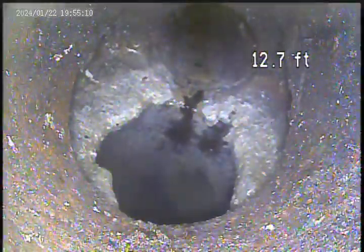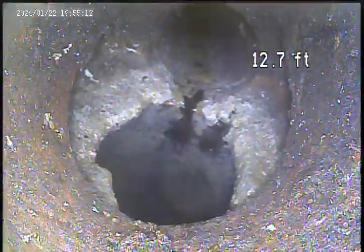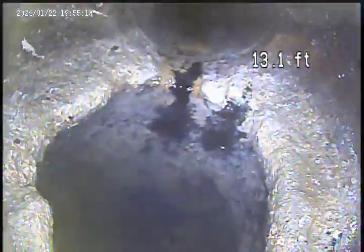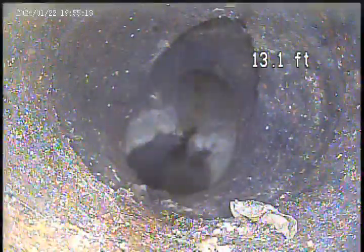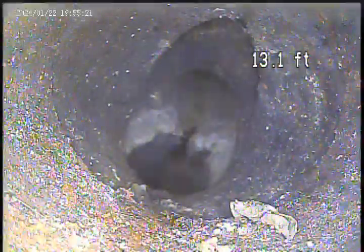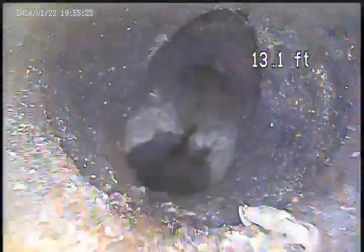I'm going to do the vent outside the front left. The vent is offset from the house trap. We do not have access to the house trap at this time. The house trap is buried by a workbench in the basement near the front foundation wall. I can't get my camera to make all these turns and get out to inspect the line, so we're going to need access to the house trap.